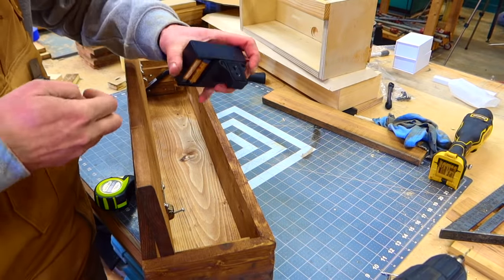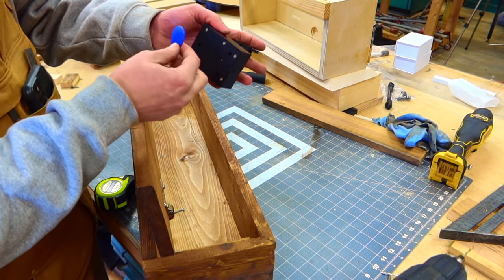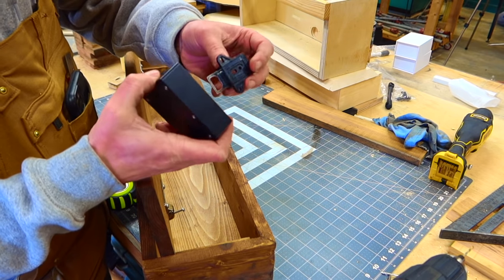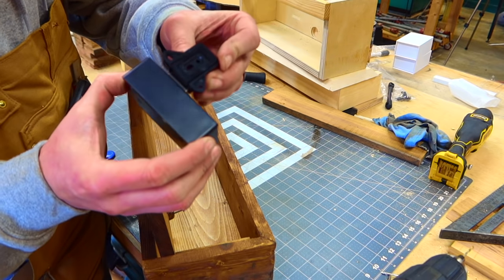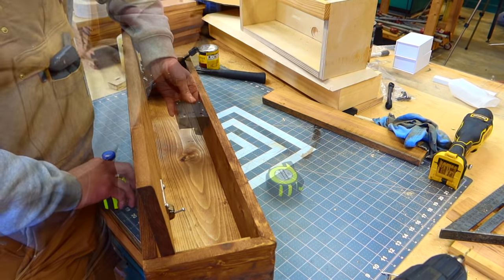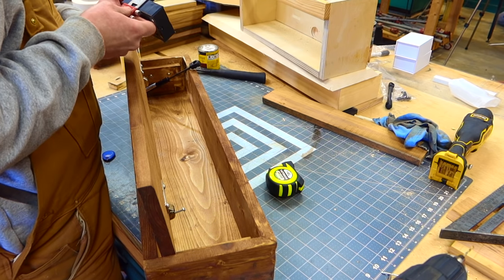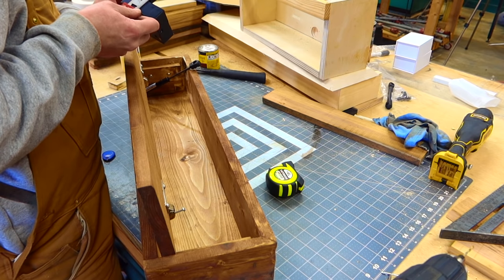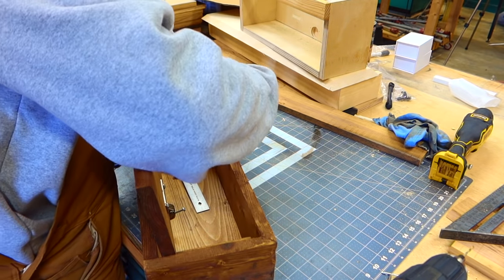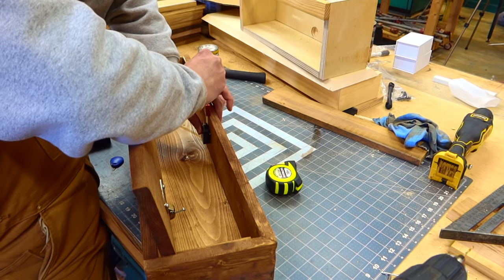For this build, I'm going to be installing an RFID key fob lock. This can work off a key fob or a card, and it will actually read through the wood. I'm sticking with the same company I use for my other builds because I know they're quality products — I've ordered other things trying to save a buck and ended up blowing my money. This company is based out of the United States, so if I ever have any issues I pick up the phone, give them a call, and they answer. I'll throw a link in the description for this lock. For the lock and latch installation, I'm measuring the thickness of my lock, then adding three-quarters to account for the bottom that is coming up, so I know the depth I need to set my latch.